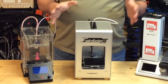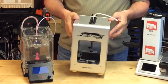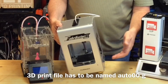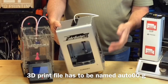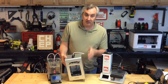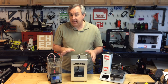Here it is fully assembled. All I had to do is connect the Bowden tube to the extruder and install the spool holder. From there I just slid in the micro SD card and there's a switch. When you put the SD card in and power it up, the switch is orange. You press it, it turns blue, and that indicates it's going to start printing. Press it once to pause it, press and hold for four seconds to cancel the print. But there's no indication of temperature or time or anything, so you really need to hook this up to a computer.